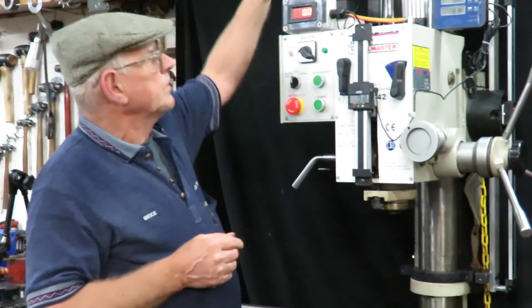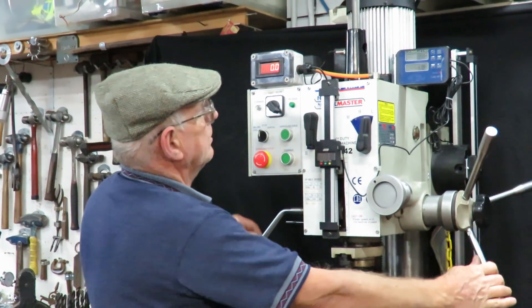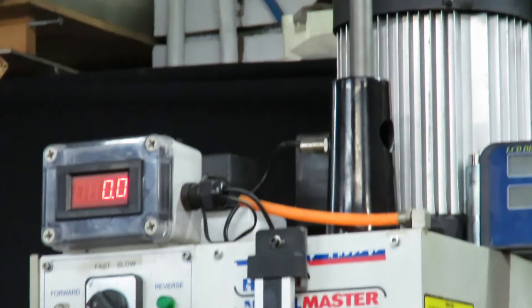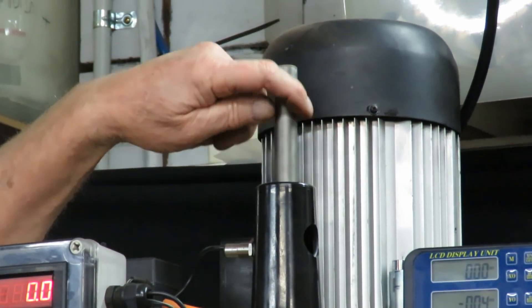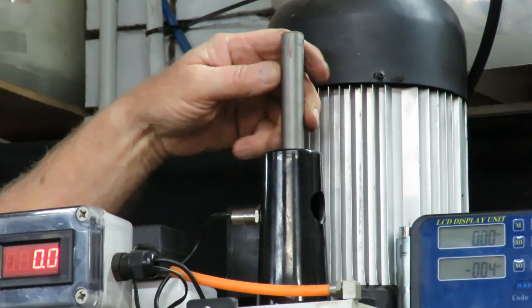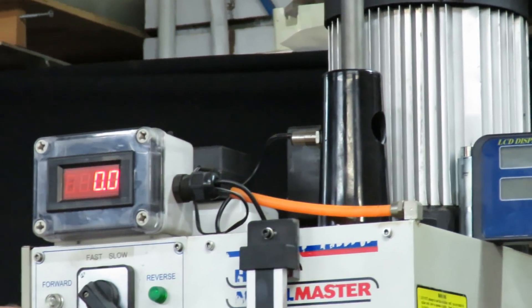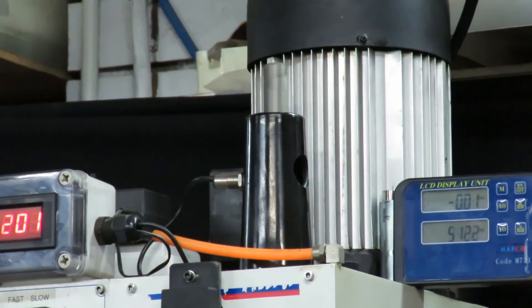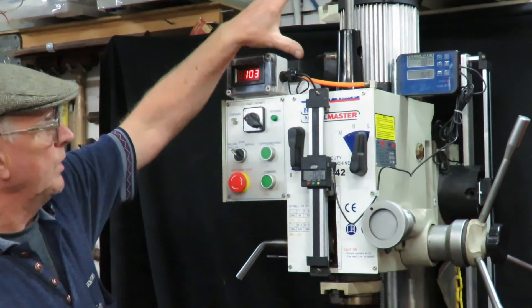The first improvement is we've added on a shaft. What I've done is drilled and tapped into the hollow part of the drawbar and made up this shaft with a set of permanent magnets in it. There's a slot in the side and those magnets are glued in. As that goes up and down, we're getting a pickup of the speed. So when we start it, it picks up the speed anywhere as I move that down — it's picking up the speed of the machine.